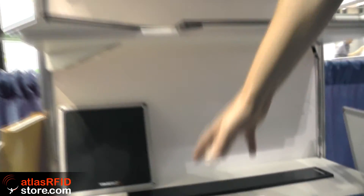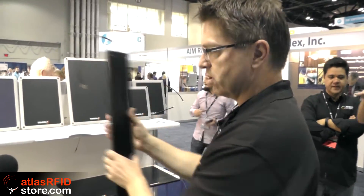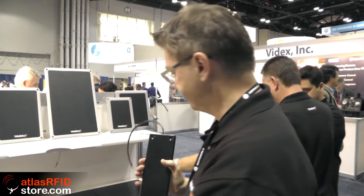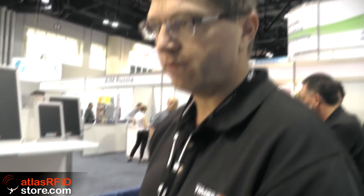We've got down here some of the antennas that have been getting quite a few opportunities in things like laundry. This is getting used a lot now in linen laundry tracking applications. We have our door frame antenna, which is a very unique form factor. This can make any kind of door entry point into a portal — you have this on the left and on the right above, and combined with a ground antenna, you've basically created a portal out of existing infrastructure without putting up any poles or frames. We're also going to offer customers low loss cables as an accessory, because if the cable length is too long you're going to lose some of the RF signal.